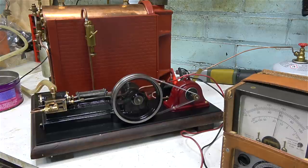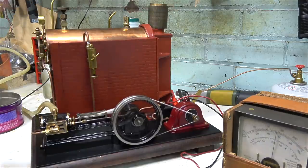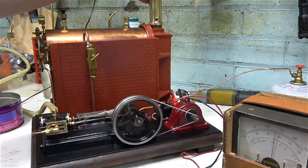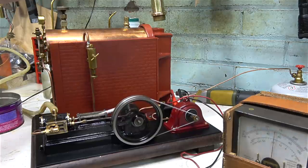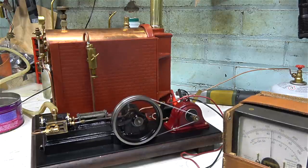It's been blowing off at 50 pounds per square inch for quite a while and the boiler pressure is not gaining on the safety valve. Time to run the steam engine and find out what speed it needs to generate six volts — and it's quite respectable, not too fast and not too slow. As you can see on the meter it's showing just under six volts. The main reason for this test was to check whether putting a condenser up the chimney would work — and yes it is, because the piece of brass is cool enough to lift off with my fingers.